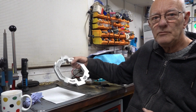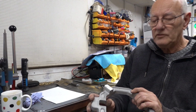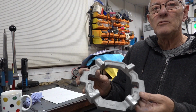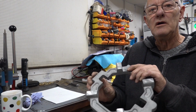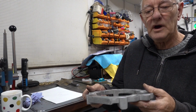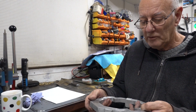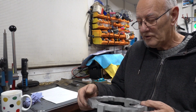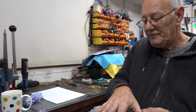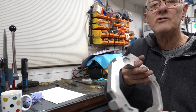Right, so we've had a reasonable amount of success on this. As you know, the first thing I did was machine those pads, which came out okay. Then I turned it over and sat it on the milling table and found that I had nothing to cut it with, so I messed about, got that fly cutter working out of that boring tool and clamped it down, but I could only get 3 clamps at a time, so I had to do a corner and move the clamping arrangement.